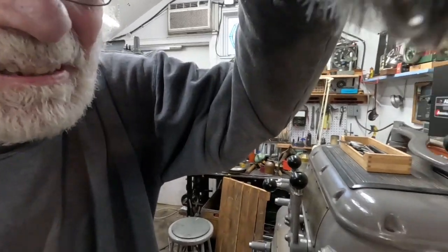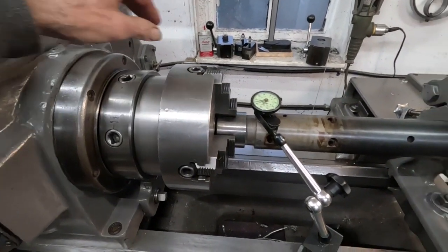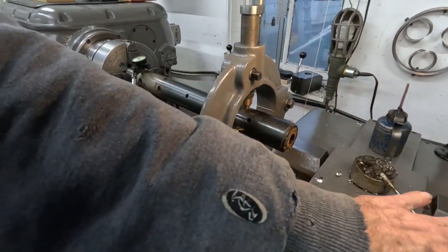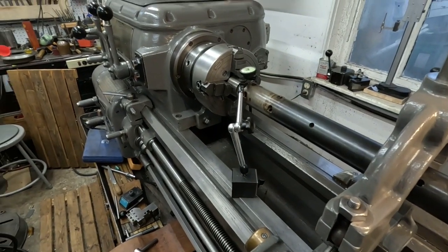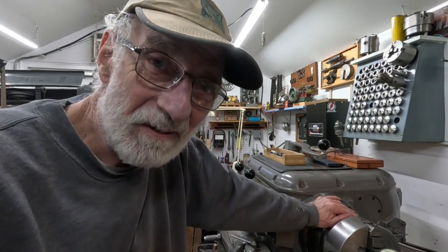Hey, Merry Christmas. This is Dawn in Walla Walla, Washington. I can't help myself. This is the day before Christmas, and I'm out here early in the morning goofing around the shop for a little bit. I've got this piece of steel here I'm salvaging, and I got it in a four-jaw chuck, holding it in a steady rest. I'm going to bevel this in to hold it with the bull center. I think it's a nice piece of metal. It's hard, and I'm just going to play around with it and see if I need to anneal it. I think I could use a piece of this for a first metal housing or something. It appears to be pretty nice metal.